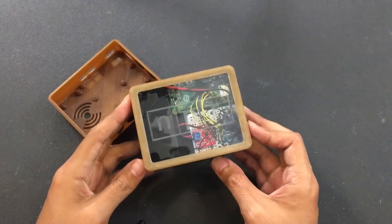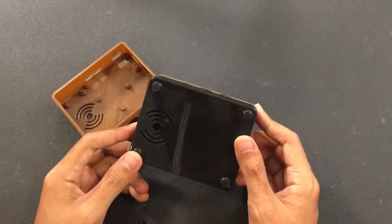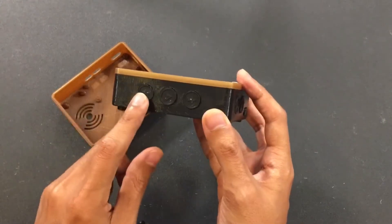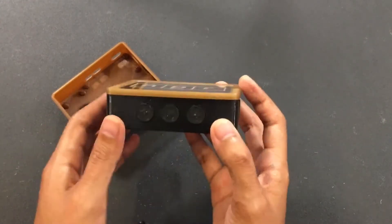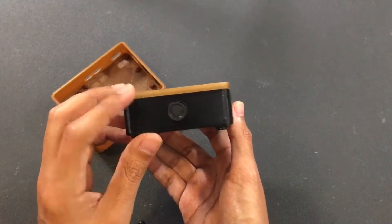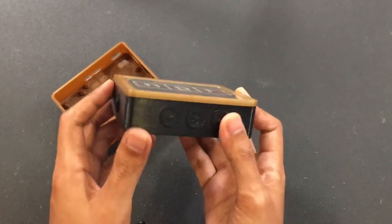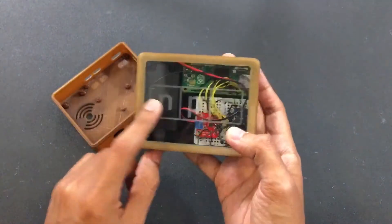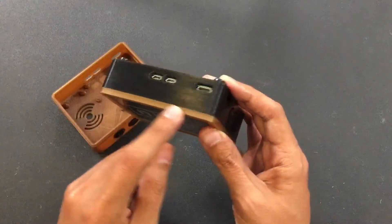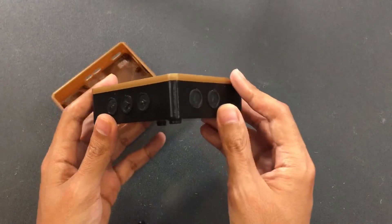This is the NPR radio project we came out with a couple of weeks ago. It uses conductive PLA buttons — you touch them and they control the NPR radio app. They're printed separately, and this black here is regular PLA. The top is CNC milled acrylic, and this cover is hemp PLA — a wood base PLA — so there's a cool contrasting color.